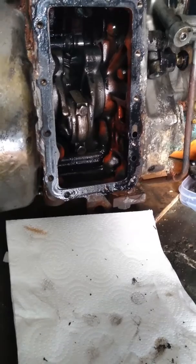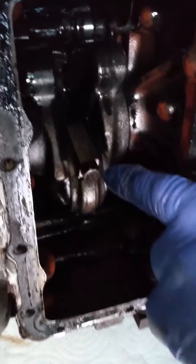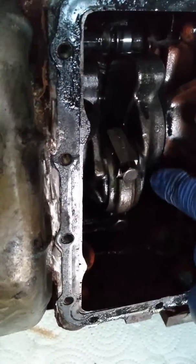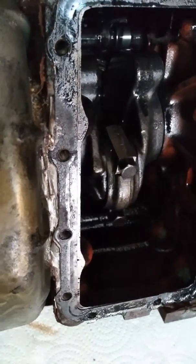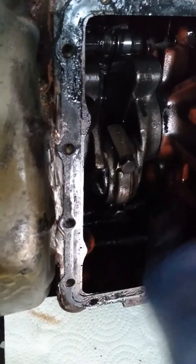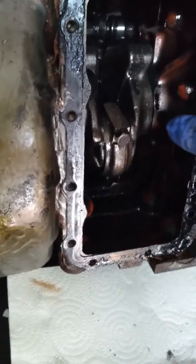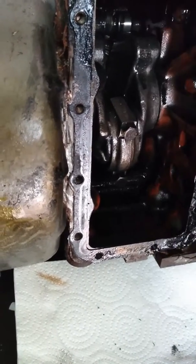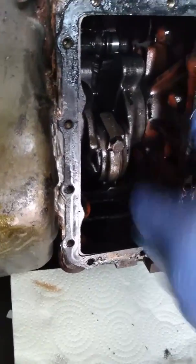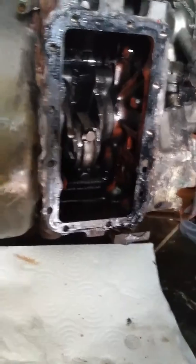So there's a number 12 on the camshaft side. There might be a different number in your engine, but there's a number 12 on the camshaft side of the big end caps, the big end cap and the con rod. So number 12 goes to number 12, and the other side has got no number in it. And in case we lose our mark on the piston, that number goes to the fuel pump, which is the camshaft side of the engine. So that'll tell us which way round to put the piston. So we're going to carry on and take this off now.